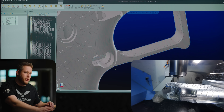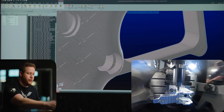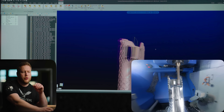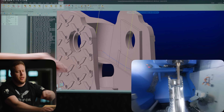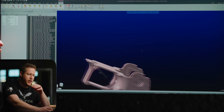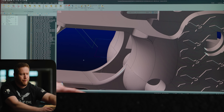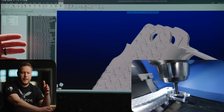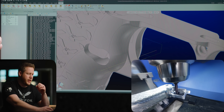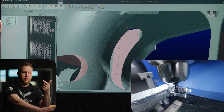Next we'll come back in with that 1/8 inch end mill and finish out this slot. Then we'll come in with our grooving tool and make our groove for the little boss, and then with our horn grooving tool to groove out this bottom piece and the back side of the pad for our trigger. The very last toolpath is for the trigger bow slot — there's a little flat at the bottom that we can't reach any other way other than a key cutter. So I'm going to come in with a 5/8 diameter key cutter to take care of that remaining stock, so our trigger bow can sit forward as it needs to. After that last keyway cutter runs, all our operations on the 5-axis are done.